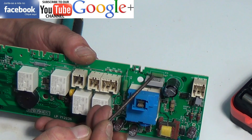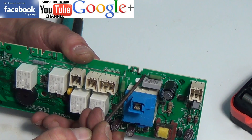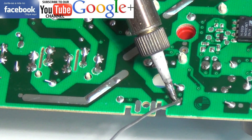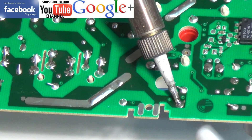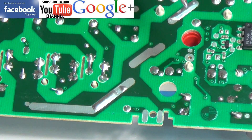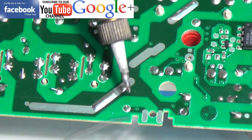There are many reasons why components fail on a circuit board, usually due to an appliance motor or heater. But on this occasion it is the link switch that actually fails. I don't have the exact reason why it fails — it's just a weak link on the circuit board. I did test the motor on all the other items and there was no major component failure, but the link switch has actually gone, and this has taken out the resistor.